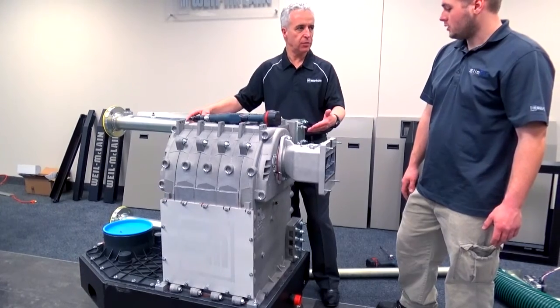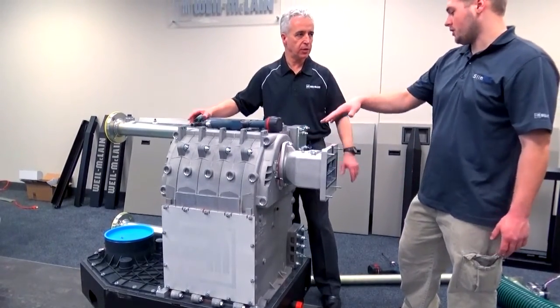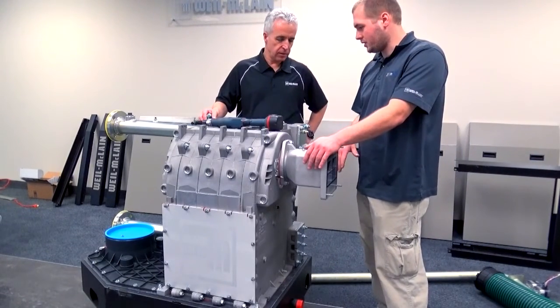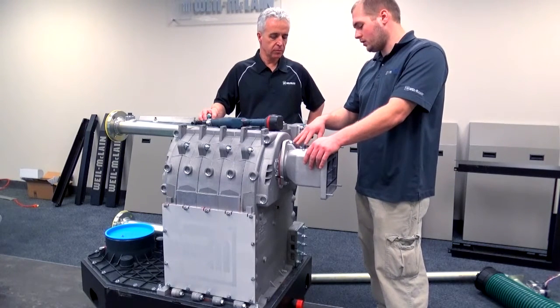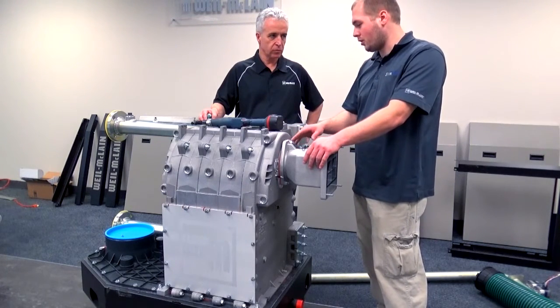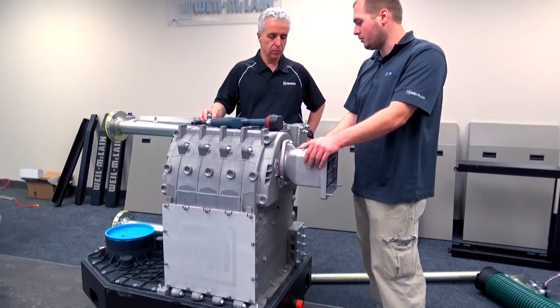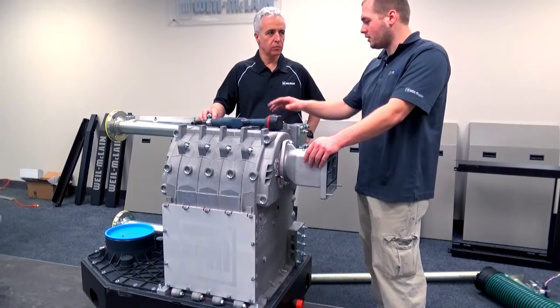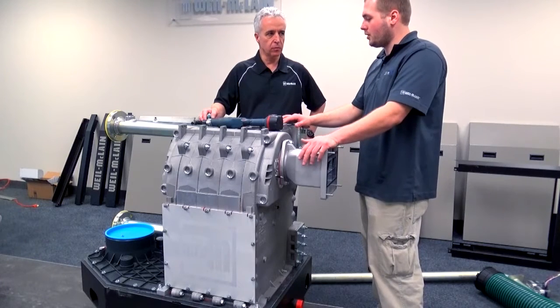Anything else that needs to be done? Is this still a one-person disassembly? Once it gets to this point, it will require 2 people, because when you start the reassembly process, currently the mixing tube is holding the burner in place. It's supporting it. But when you remove this, if you need to, you will have to have somebody else help support it while you tighten this down to make sure that the burner doesn't fall out or slide out of place.